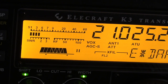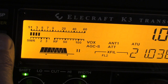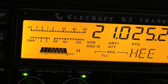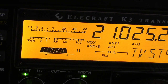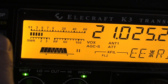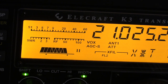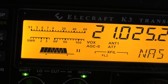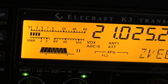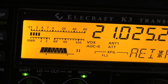Now finally let's have a look at 21MHz. Press the auto ATU button — it won't tune. But again, even though there is no auto ATU switched in, we get 100 watts out and no VSWR. So that proves beyond doubt that this antenna is almost perfectly matched to the specified bands.